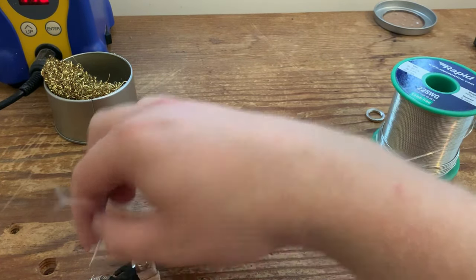I've used some rubber tubing here just to be covering the braid that's running between all the pots, because when everything's screwed down, what you don't want is for the ground, the outer braid, to come into contact with any of these lugs. Like if the braid was to hit the lug of the tone pot here where my finger is, that would short out the tone control. Likewise, if it was to hit the inputs of either of the volume pots, you'd have no sound either. So that's the reason for the rubber tubing.